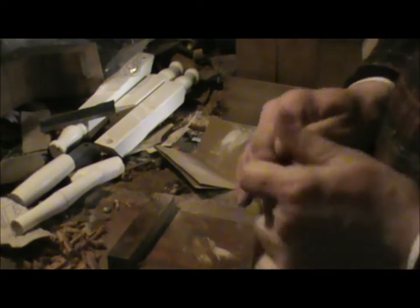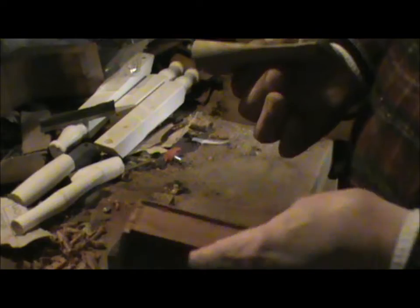It's a slow process doing it by hand using sandpaper — I've got a variety of abrasives, sandpaper, glass paper. Slow job, but I'm losing nothing by doing it the hard way. The choice was watching telly, so that's why we're doing it this way. It's not suitable for doing it with a machine because it's veneer — it's a very flimsy piece. Can you see how thick that drawer front is? It's not exactly chunky. Hit that with a machine and you could go through it, wreck it fairly quickly. So we do it the hard way — it's good therapy.